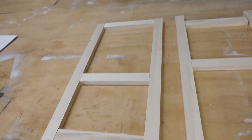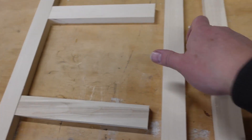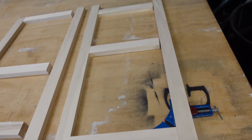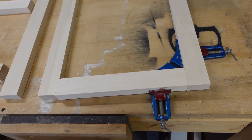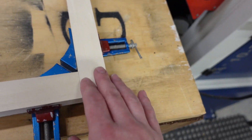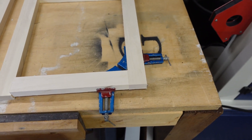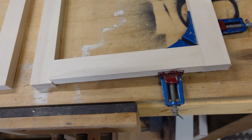This is what the basic construction of the side panel of the shelves is going to look like — it's not put together yet. I don't have a good doweling system or a biscuit joiner, and I certainly don't own the Festool. So I'm using these to hold it as square as possible, and I'll glue it and then come back later and dowel.